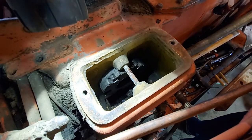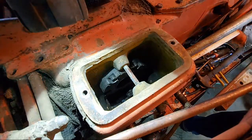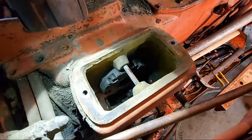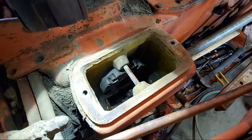but I need to get a new regulator for this oxygen tank. You guys hear the popping? It's because I added a hose and I can't set the regulator correctly because it's broken, and so now I deal with this.